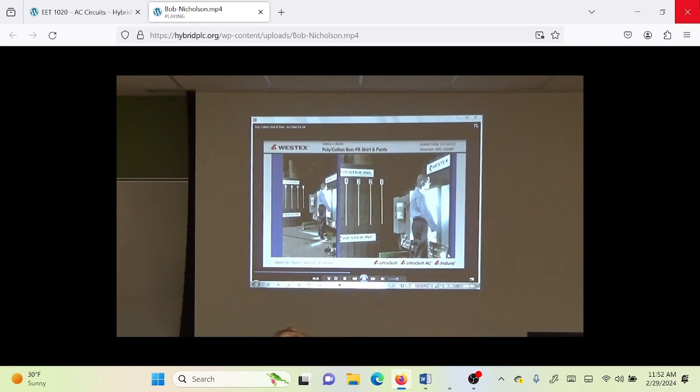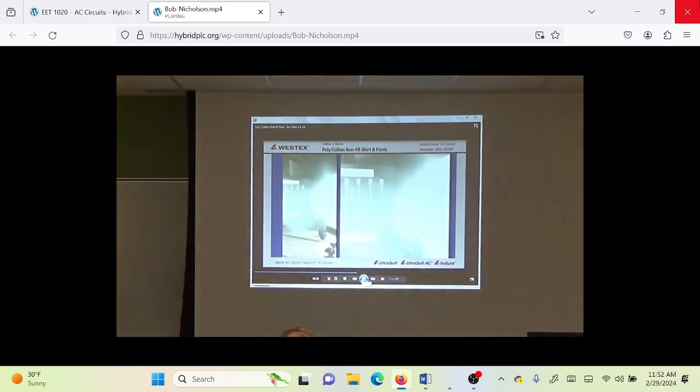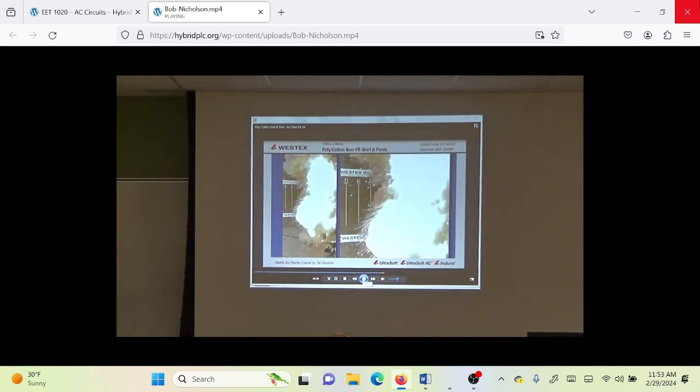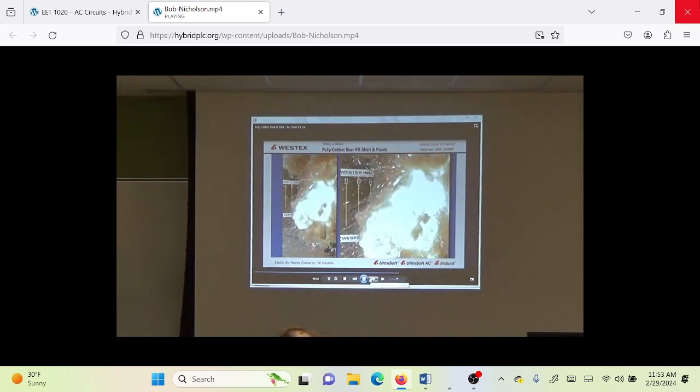Now watch what happens. As this fault begins, at 3,000 frames a second, you get a terrific look at the arc. It comes out, hits the mannequin, and bounces to his right and left and down, but never gets his back. Now, if you don't have protective clothing on, first of all, OSHA will be rather upset with your employer, because if you open that panel, you have to have a certain level of protection against that heat, because you won't be around otherwise. And in a moment, as the arc starts to subside, you'll see the garment on fire as the smoke clears and starts to rise.